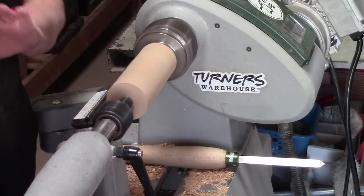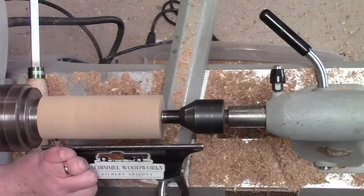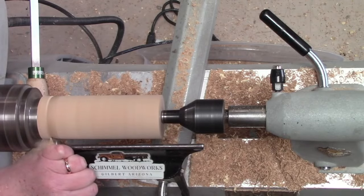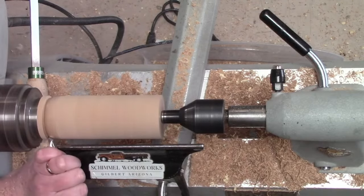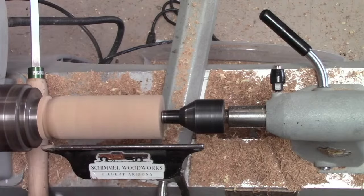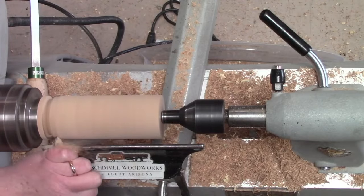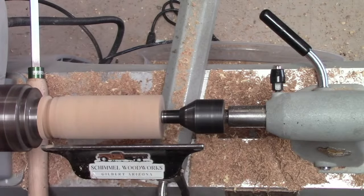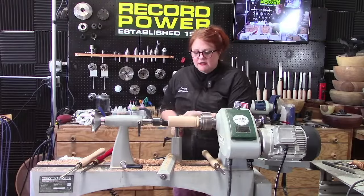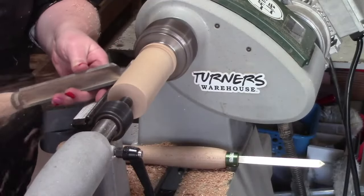We're going to take our spindle gouge. We're going to anchor, find that bevel, rotate over, and make a cut. We're turning a big bead. And this is going to be a hefty rattle if we don't take some stock off. But I always like to start with a bigger blank so I have room to work. I'm going to take some material off because I don't need this all. I've been looking at it. I've looked at my blank. We're looking good.